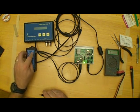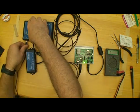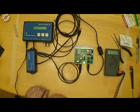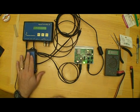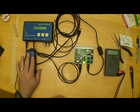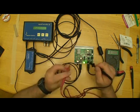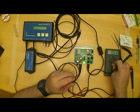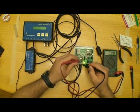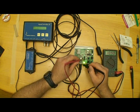I've got power to my Aquasurf — I can see the lights are on — and now I'm going to hook power to the Aquacontroller. I've already got a program in there set that will turn the power on full to the pump, or to the Aquasurf and to that particular pump. I can check the voltage, and I've got it set to 20 volts over here. All I'll do is check the incoming voltage on this pin right here. It says 10.9 volts — that's about right. 10.8, 10.9 volts.